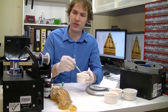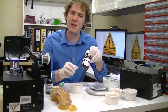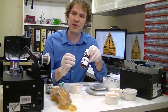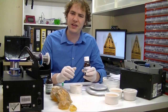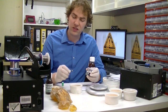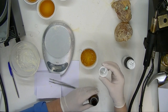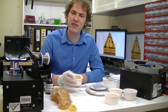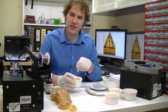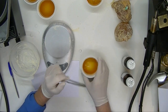After 24 hours or so this will dissolve better and should be a nice flux. The patent we read mentions using glycerin to stabilize the flux and also to keep it from burning. This isn't strictly necessary, but we have some handy so we're going to add some. It's just supposed to be 1% by weight — literally just a drop or two. That's our finished flux. We'll leave it overnight to fully dissolve, then stir it up a bit more. For now we'll work with one of the ones we started yesterday — the thick one.